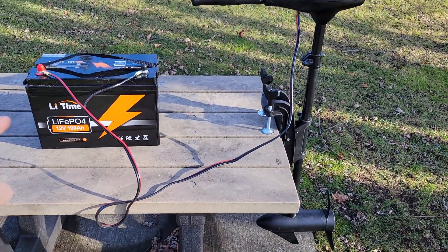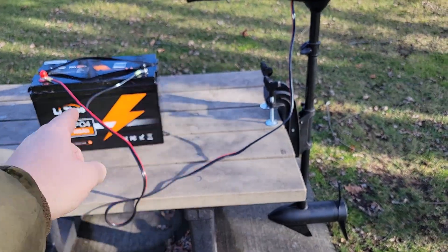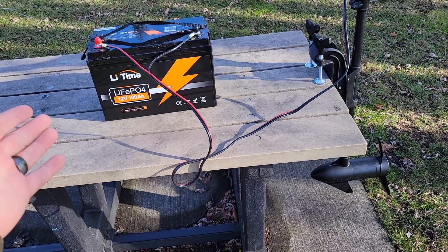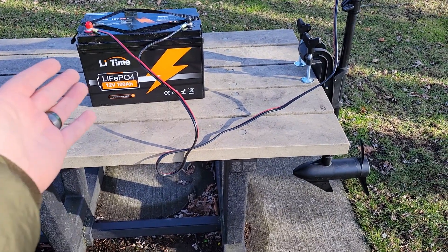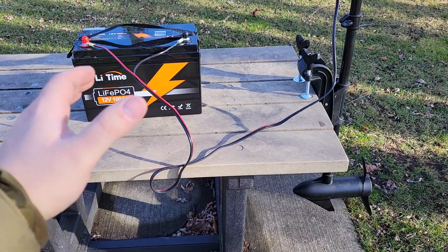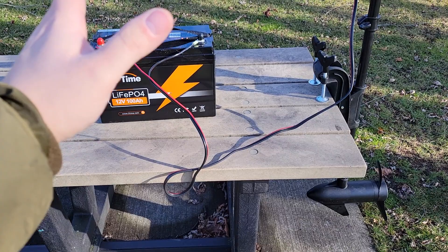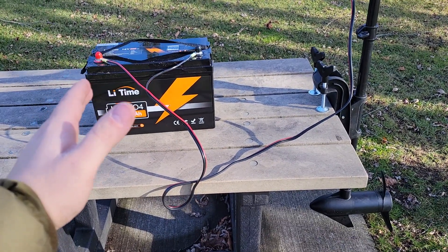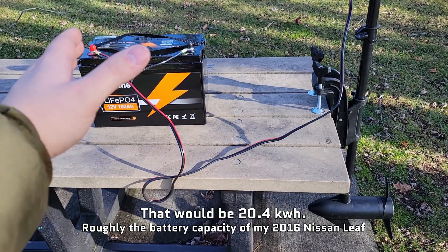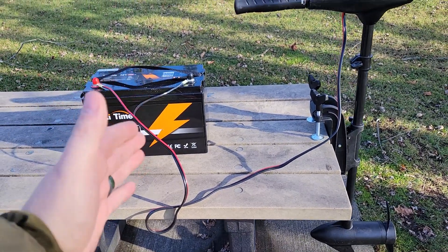Because this isn't just a raw battery, it actually does have a BMS — I can run this thing until the battery goes empty and not have to worry about over-draining it. When I charge it, same idea: it won't overcharge because unlike a lead acid battery, it's fully protected by an onboard BMS, which allows for a max 4 series 4 parallel configuration. So you can wire up to 16 of these things together for a 48 volt 400 amp hour configuration — that's actually pretty wild.